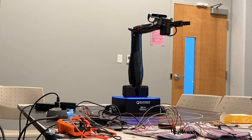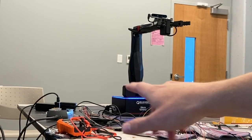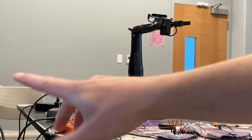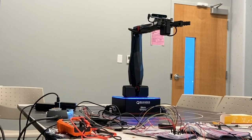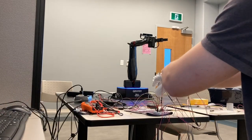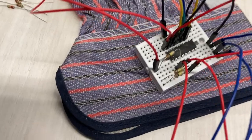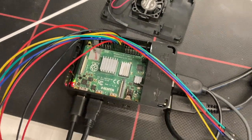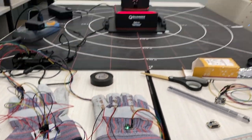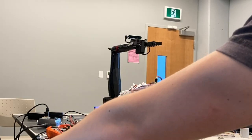What I've done is create a glove that uses an accelerometer to control the base rotation of the Q-Arm. With one finger it controls the gripper, another finger controls the shoulder joint, and the last finger controls the elbow joint. The code takes input from the accelerometer and from flexible sensors which feed into an analog-to-digital converter. A voltage divider circuit produces a range of values that maps each finger's bend directly to the angle of each motor. For the accelerometer I did a calculation for pitch as well.